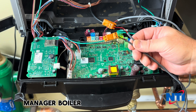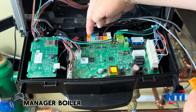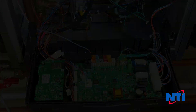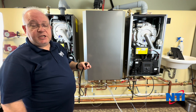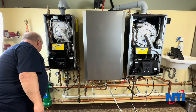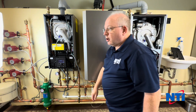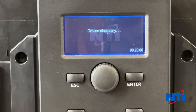Now we're going to connect our e-bus together — it connects to the bus connection on both appliances. With the interconnection between the two appliances established and the system sensor installed, our TT1 connection will eventually connect to a zone controller or T-stat. Now we power up both appliances — turn on the master, then turn on the follower — and wait for them to establish the cascade. They'll reboot and initialize, doing device discovery.